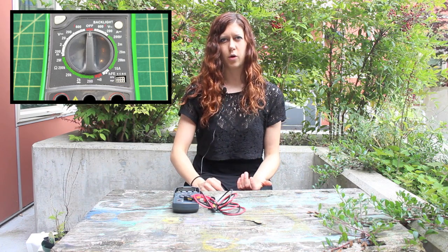You can also choose between auto-ranging multimeters, which basically detect the range of your measurement for you — which is really convenient. Or you can choose a manual range multimeter, which forces you to know a little bit about your measurement before you take it, or you can just start at the highest setting and work your way down.